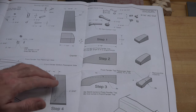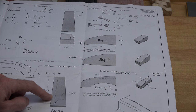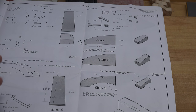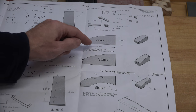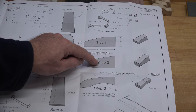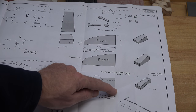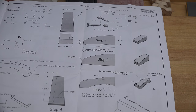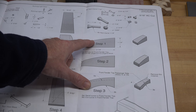Here we are looking at all the steps: the plans show you a top profile, a front profile, and then the steps and what the piece should look like when done. Now I don't necessarily agree with their steps, but my first process is to make templates of these profiles — not so much for step two since it's only one chamfer, but for the main shape, the side shape, and the chamfer along the side. I'll be making templates for those two, photocopying the patterns, attaching them to MDF, cutting them on the scroll saw, and sanding up to the line.